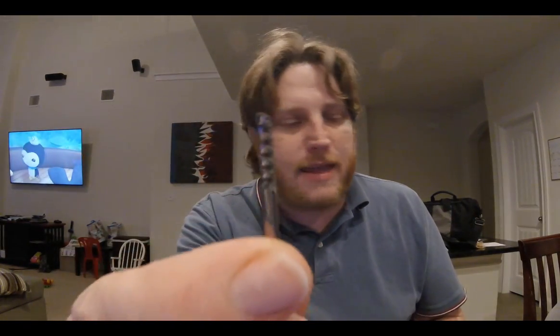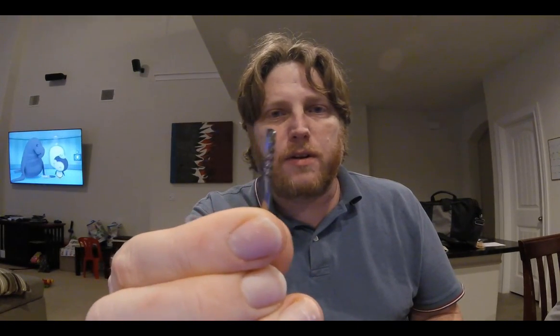I have been doing Excel spreadsheet math. I have decided that I'm going to use chip load as gospel, and I'm going to build all my feeds and speeds off of optimal chip load. Bottom of the range optimal chip load, but chip load is what I'm focusing on. So I've got quarter inch, 65000. I've got this little guy, it's an eighth inch. Same thing. These are all single flute, spiral, upcut. They're all also carbide.